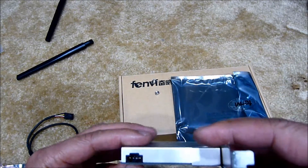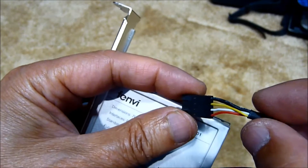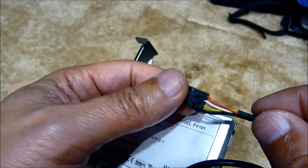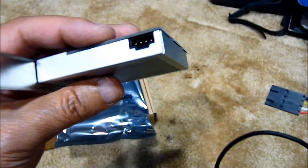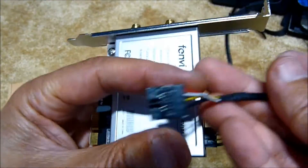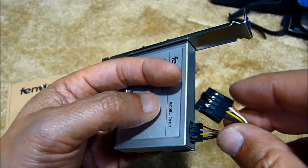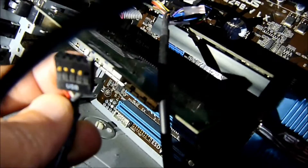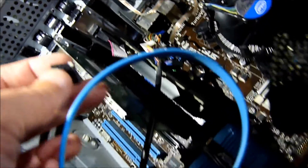This is the Bluetooth cable. Looking at the wires: red must be five volts, black must be ground, and yellow and white must be the data twisted pair. Let's plug this in. On the other side, we plug into the computer's USB. Checking the USB pinout: the plus is on this side, and the bottom center pin is ground. It looks like they wired it correctly.